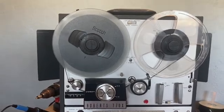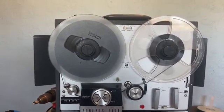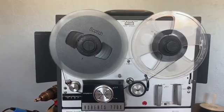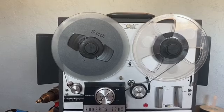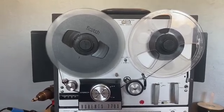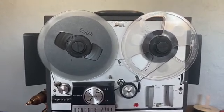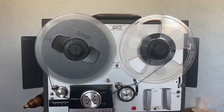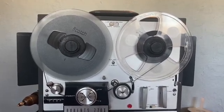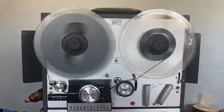I also changed out the run motor capacitors, which I talked about a little bit in the last video. There are several of them and they're AC capacitors. Before, as you used it — I guess as they warmed up — when you would fast forward and rewind, more on the fast forward than the rewind, it would slow down and usually stop once it got through about three-fourths of the reel. But now it seems to be working really well on fast forward.